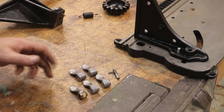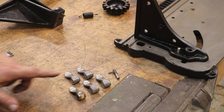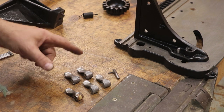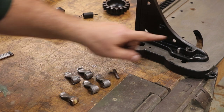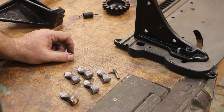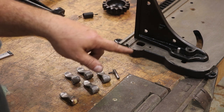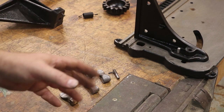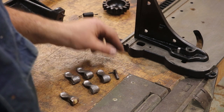This is made out of cast iron, and that was done by Clark Easterling — Clark has Windy Hill Foundry over in Mississippi. It's a fairly new foundry I've been starting to use, and he was able to take this piece, mold it up in the sand, and get me back four new levers within about a week or two. My challenge now is I've got my tapered pin and we've got to do some machining work to the levers to get them working properly. I did have to use a different pin size on both sides of the miter trimmer — one side has a larger pin than the other.